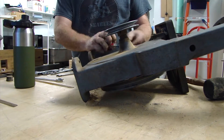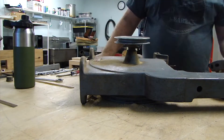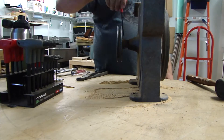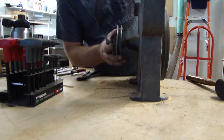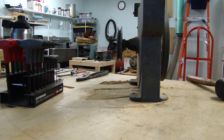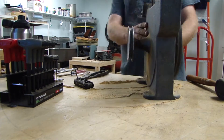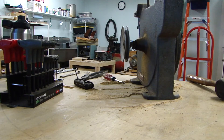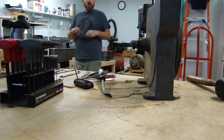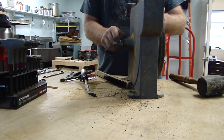So I can't really see the set screws and things, so I decided to take this table off and then I'd have a better look at the wheels. I believe there's a Woodruff key under there, but there was just a set screw holding that pulley on. There's like a stop collar between that pulley and that bearing hub. So I just loosened both of those up. It was a little bit tighter than hand-tight, so I ended up getting a screwdriver and a little bit of pry bar and prying them off, but they pried off super easy.